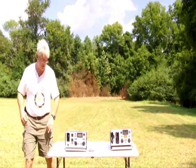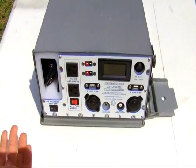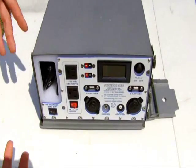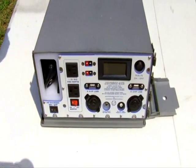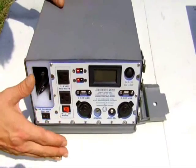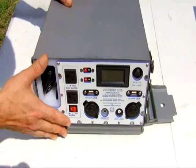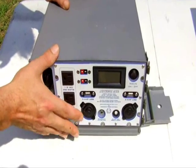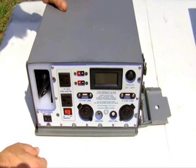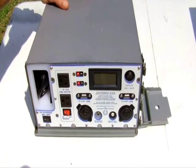Come on up closer and we'll take a look at the faceplate, give people an idea. One of the things we're doing differently with the Mark 2 — obviously it's prettier, the faceplate is being cut CNC — and part of it is because there's simply more going on. The Juice Box Mark 1 is straightforward enough that you probably know how to run it out of the box. There's a little more going on with the Mark 2. The can is completely filled, so unlike the Mark 1, there is no provision in the Mark 2 for an internal solar panel. One reason is we don't have the space — this thing is full. The other is that with the increased capacity, a 10-watt panel like we run in the Mark 1 is simply not enough. About 25 watts is the minimum to use with a system like this, and a 25-watt panel definitely is not fitting in this case.